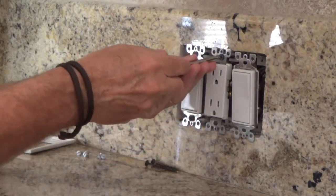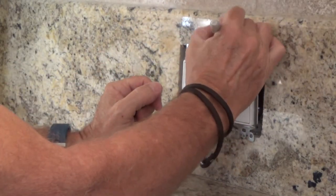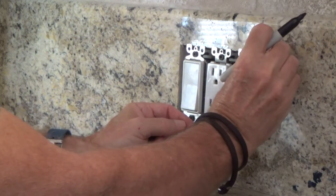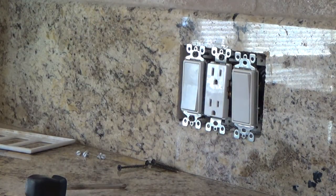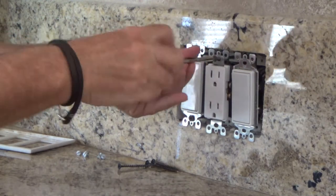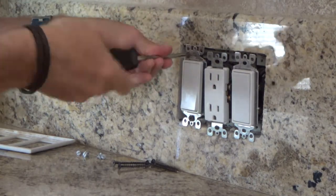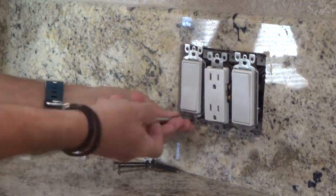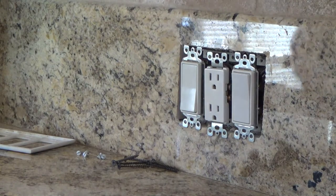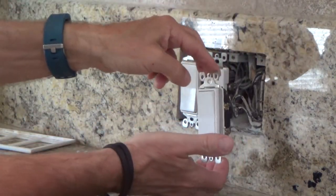I know all the power is off but I'm still gonna be as careful as I can. I should have taken a felt tip pen — I'm just gonna dab it right about where these were before so that my cover plate will fit on there and I can adjust it. Am I a licensed electrician? No, but you don't have to be either. We're not adding a circuit to the panel or anything like that. All we're doing is simply moving these things around — the power is all off.